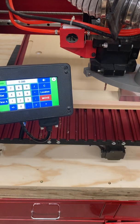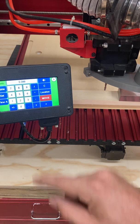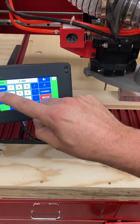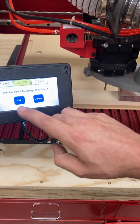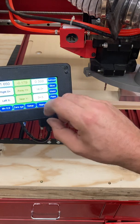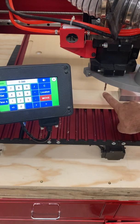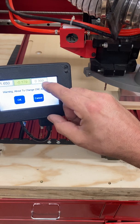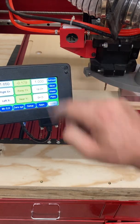So now to set zero into the machine — what I'm telling the machine is this Z height that we have now, exactly where the machine is, is our tool offset or our Z zero. So I'm going to click the digital readout numbers, I'm going to click set. Do not click move unless you want to move the machine there. We want to set the Z axis — it gives you a warning: you're about to change the axis height, so make sure this is what you want to do. We know this cutting bit is exactly one inch above the stock, so I'm going to enter 1.0 and click set. It's going to change that 0.399 inches to one inch. So now that Z axis is correct.